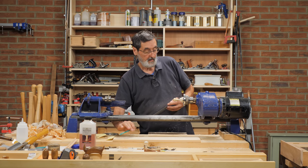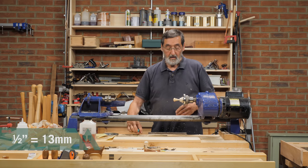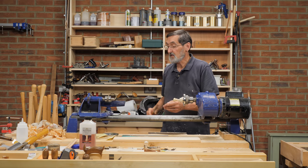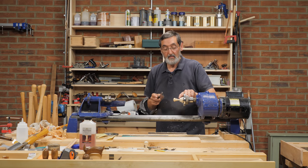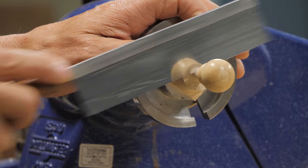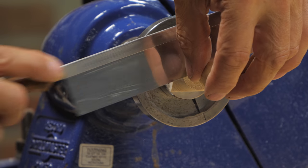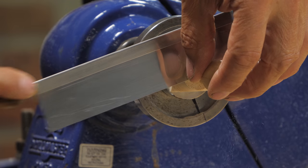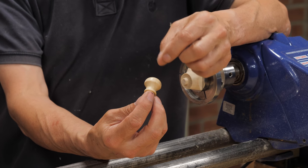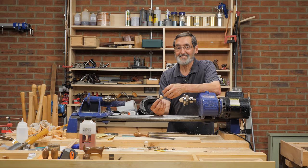The stem is half an inch long. Often you'd take a parting tool and part this off if you've left enough length on the piece of wood, or use a chisel to take it off. What I'm going to do is saw it off — I've made my mark, I know where my screw chuck is, so I'm going to saw through here. There it is — that's the finished product. I'm very happy with that. It makes a nice little button knob, and I think it's perfect for what I want.